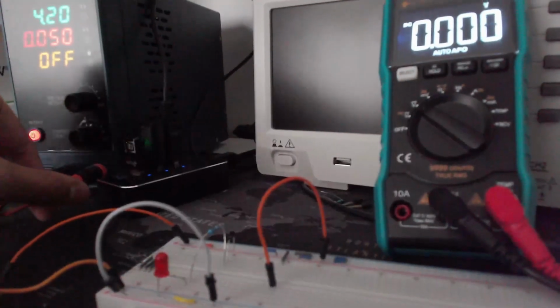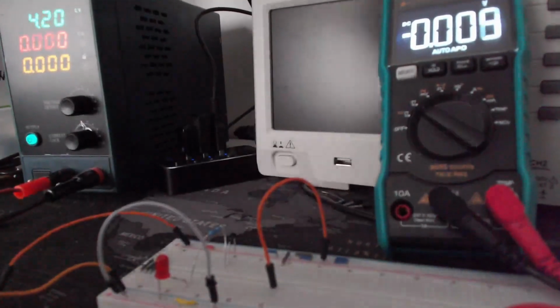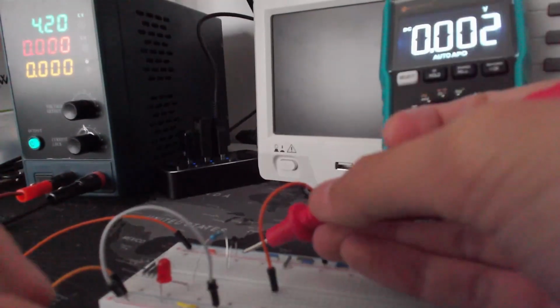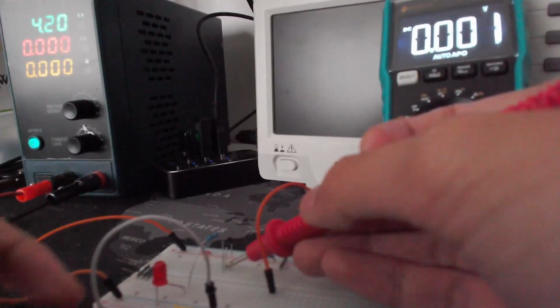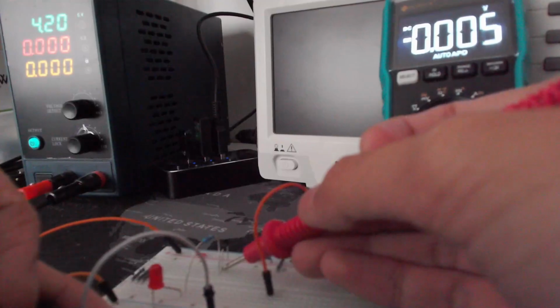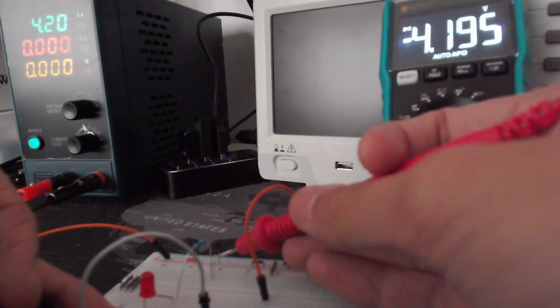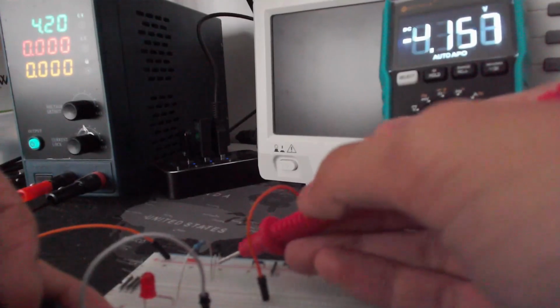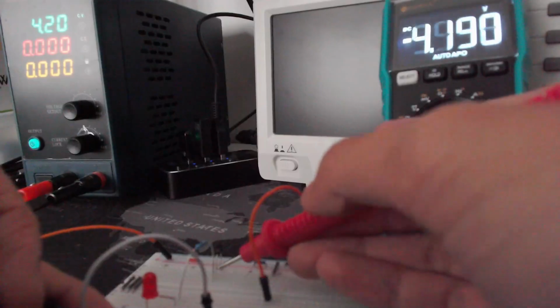And our power. Let's switch the leads around. So I'm going to switch it back on, and we are simulating what is a negative battery. So we switch this back on, and we're going to do the same thing. We get nothing on our output. Good. We get here negative 4.2 volts. So there's nothing happening over here. So it's essentially blocked.